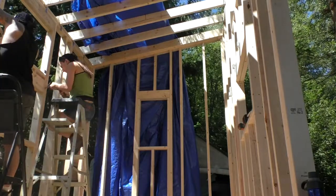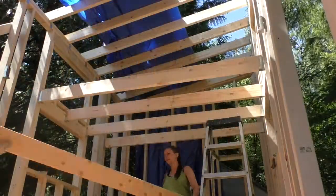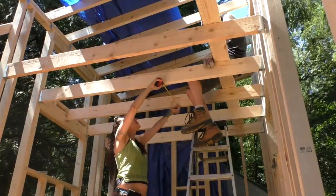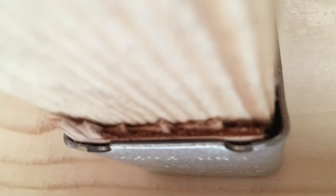We were careful to get these installed correctly, so we drilled pilot holes after marking out where each screw would go. We then simply cut the 2x6s to length and slotted them in. To verify the joists were all sitting level, we threw a board up and checked for gaps. One of the hangers was sitting a little low, so we snuck a shim in there to lift up the joist about a sixteenth.